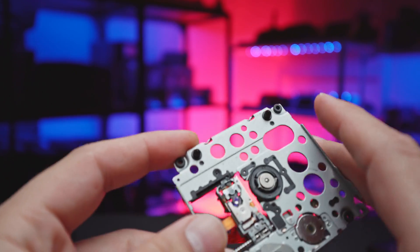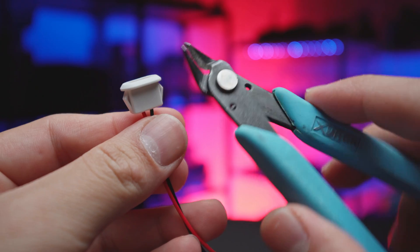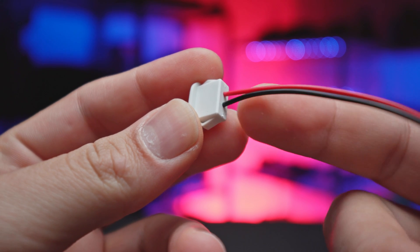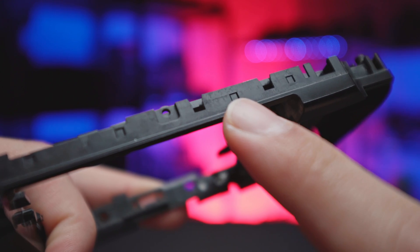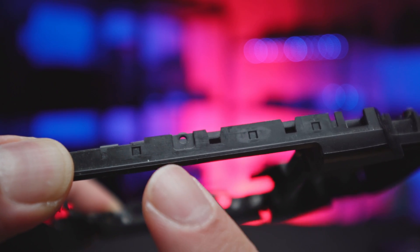Next, go ahead and remove the shell around these pre-soldered Type-C ports. Just keep snipping at it, take your time until it's completely freed. Take extra care around the wire area so you don't snip the wires off. Then remove the trim piece, grab your Type-C port and some type of marker. You want to focus on the first little square from the center, right where the bottom screw point is.